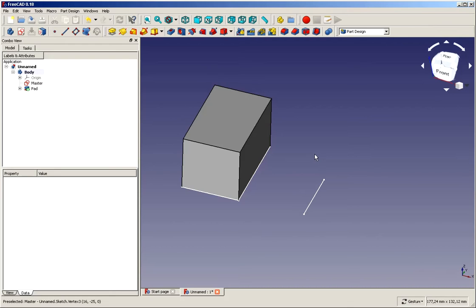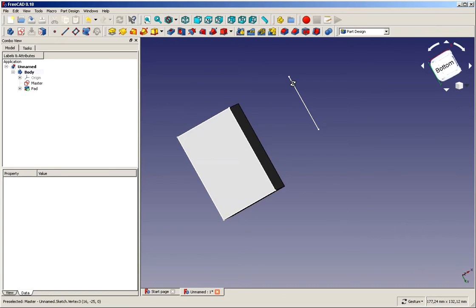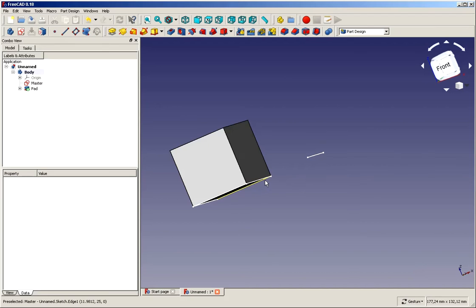The block itself is somehow mounted to the other parts of the support in this 3D printer, and the main function of this connection is a pair of rectangular cubes which we will create on this side. Now this side, as we know and as we can see if we switch the origins visible using the spacebar, is also on the XY plane.